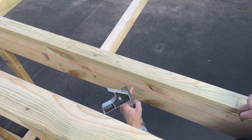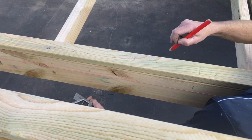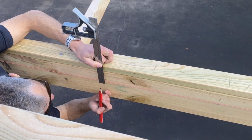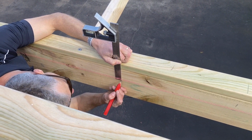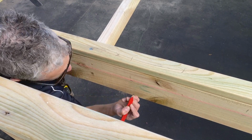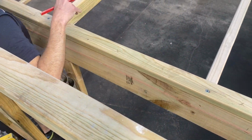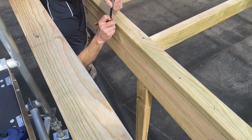Now you want both sides of your sump to be perfectly level. So this side I'm going to come down 10 mil also. And then I've got a high point, which is here. I'm going to come up above my string line 5 mil again.